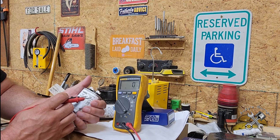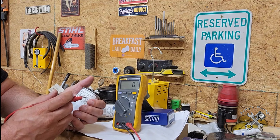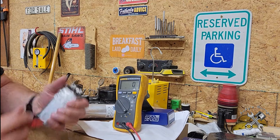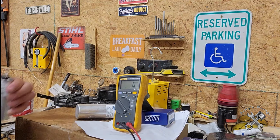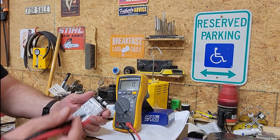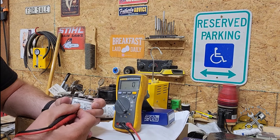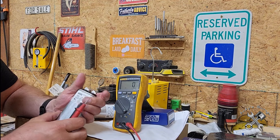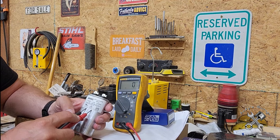On the other end of the spectrum, if you're plus six percent - that's 0.9 microfarads - you're at 15.9. This tested at 15.2, so this would be considered a good capacitor. On the low end, the minimum is 14.1, so if it were at 14 you might get away with it.